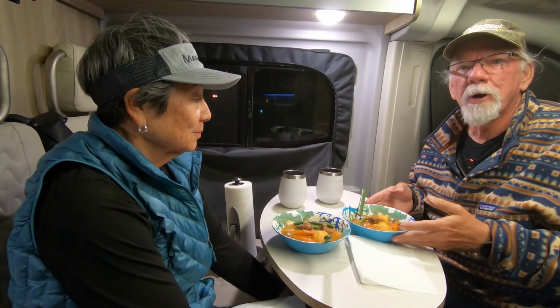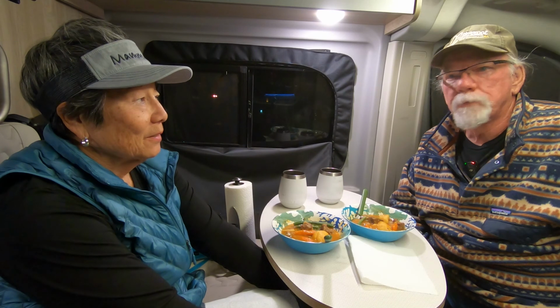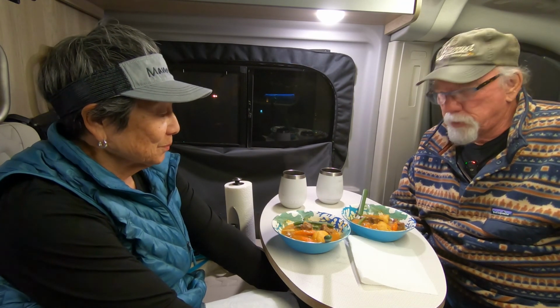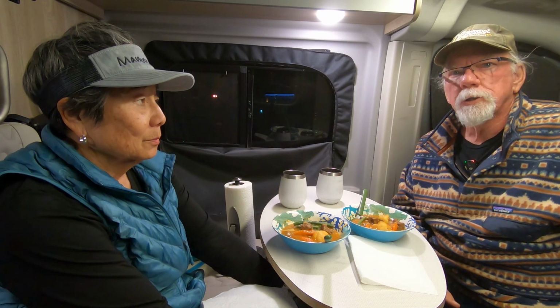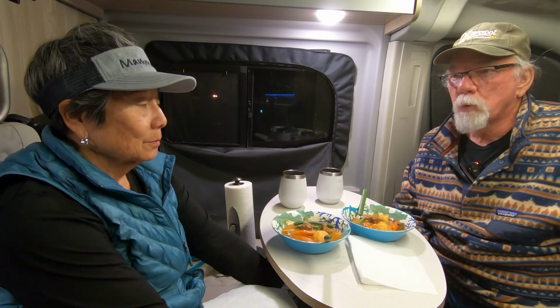Okay, so here we are. Laurie made a fantastic meal tonight using her 6-quart Instant Pot and powered by our Jackery Explorer 1500. What we demonstrated tonight is we had plenty of power. We started with 95% on the 1500, and we're now down at 55%. So more than enough capacity to drive a 1,000 watt 6-quart Instant Pot. It was interesting, it says it's rated at 1,000 watts, but really the highest we saw was about 856 watts.